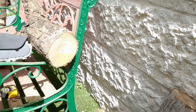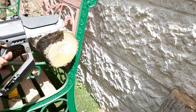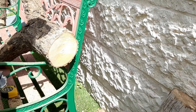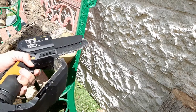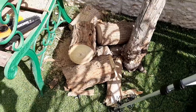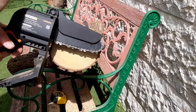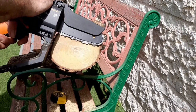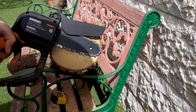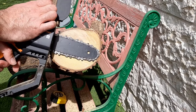Wow, that was awesome. Now you need to remember — it's getting stuck a bit. Part of the reason why it's getting stuck is because this is not a gas-powered chainsaw. This is a handheld, one-hand, battery-operated chainsaw, and it's doing what a gas-powered chainsaw can do — that's pretty darn impressive. Always important to hold the saw with two hands if you can support the wood properly. This is probably the maximum width of the saw recommended, because we're already going beyond the width of the blade — about five inches is the max.